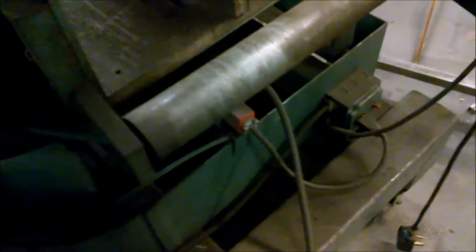And then just grind it out with a 3-inch, and then so now we're going to start the bend around here, and it's going to hook, and it'll look like a fish hook, and then at the end we'll sharpen it with a 3-inch. Alright, so I'm going to go bend it. I'm just going to use a hammer and the horn of the anvil to bend it. We bent it using the horn of an anvil and the hammer, and now we're just going to use a 3-inch, sharpen this up,